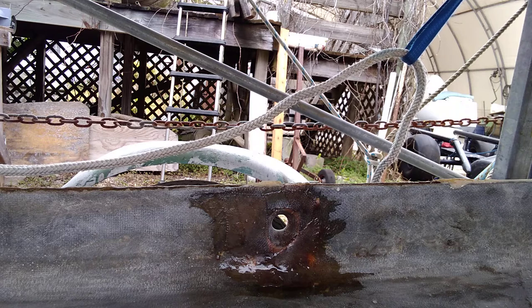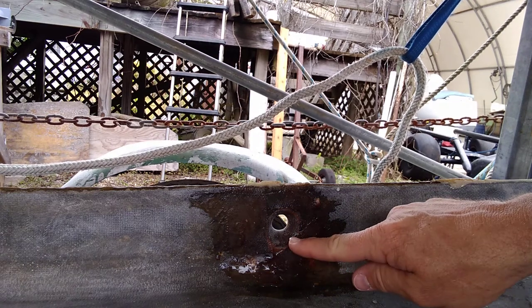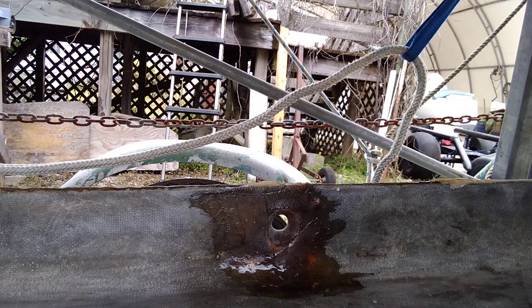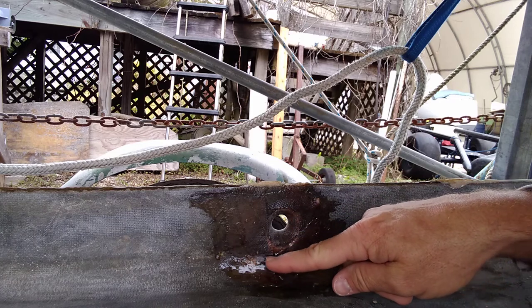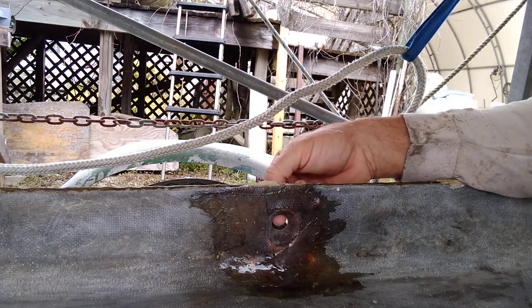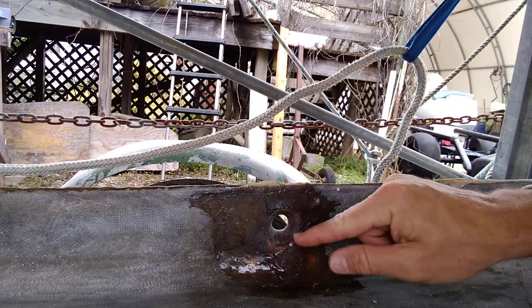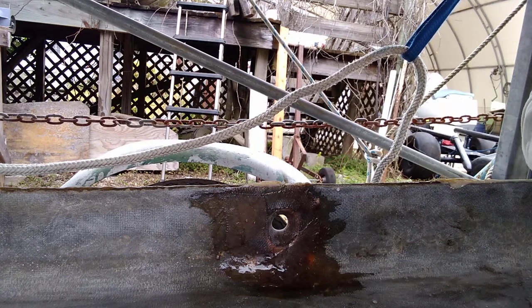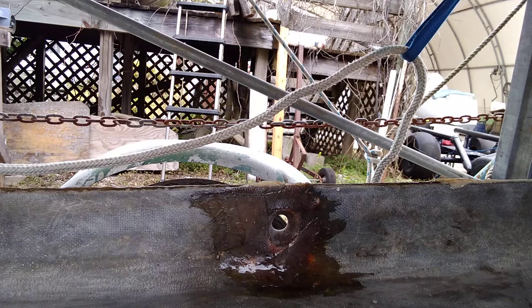My solution has been to grind out the holes as much as I could. I had originally filled them with some putty, but the putty doesn't hold or it's too thick and you have the same sanding-through problem. So I ground it out and then took four-ounce laminate, cut pieces into it — I folded it into a cone, stuck it through, and cut it so it would spread out evenly. The four-ounce has proven thin enough that I can still sand it down just slightly and get the hole through, and it seems to be covering everything nicely.